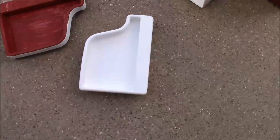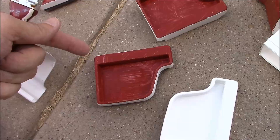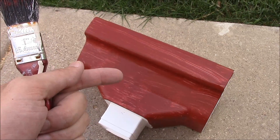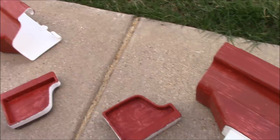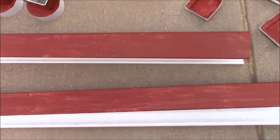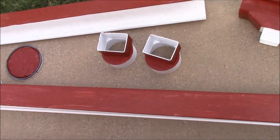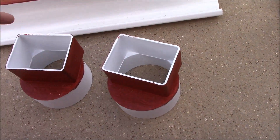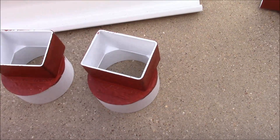After the gutters, we're going to go ahead and paint some of the miscellaneous pieces that we need to complete our gutter system. It will include pieces like these end cap pieces, these downspout adapters — I forget the technical term, but basically it's what sends the water downward from the actual gutter. And then we have these adapters — this is sold at Home Depot, a two-inch by three-inch by four-inch PVC adapter.